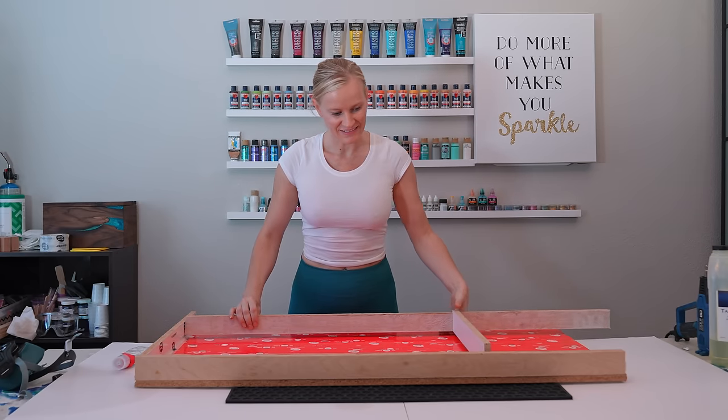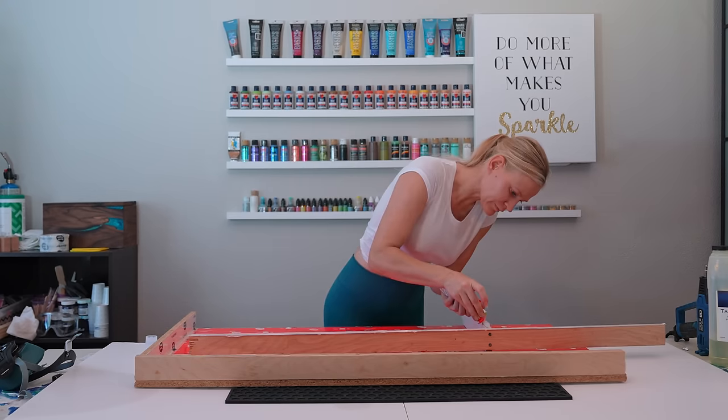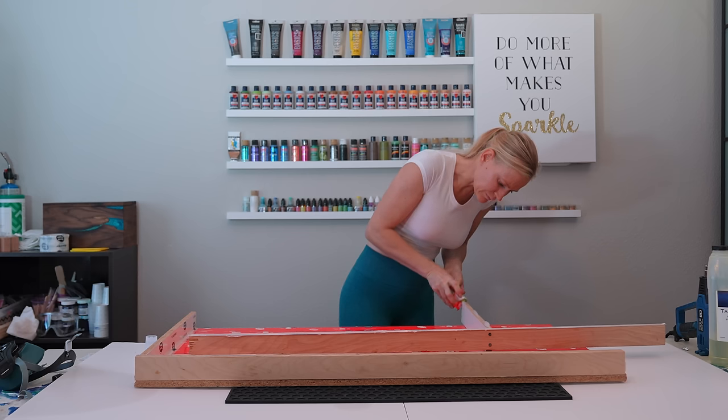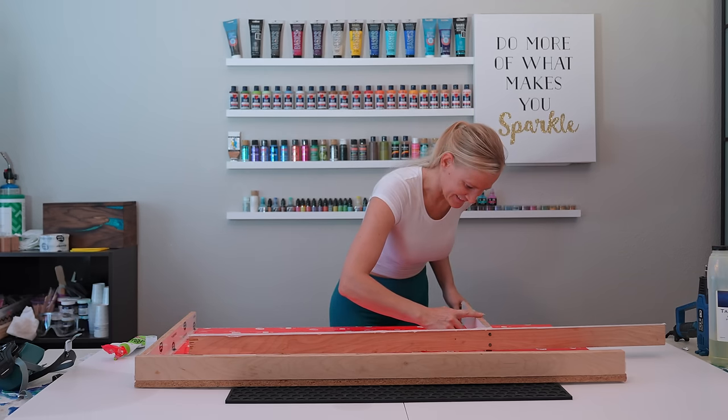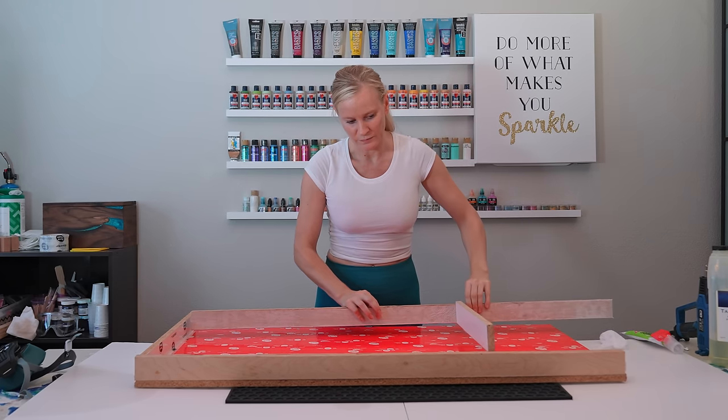While the glue is drying, it's a perfect time to build a shape for the resin pour. I'm using the two pieces of lumber that I had used to lay out the pattern earlier. I'm attaching them to a form that I had built a while ago. I just used some lumber, covered it in tuck tape, and attached it to build the form. It's best to drill the pieces together.